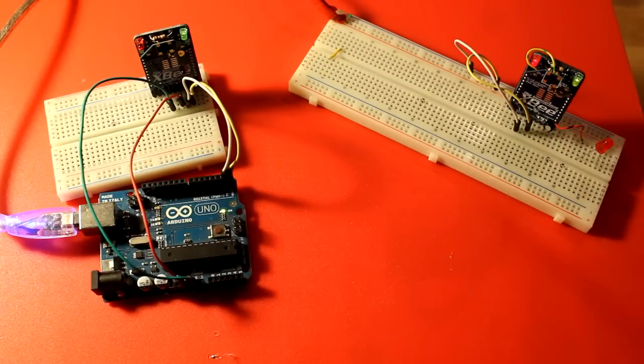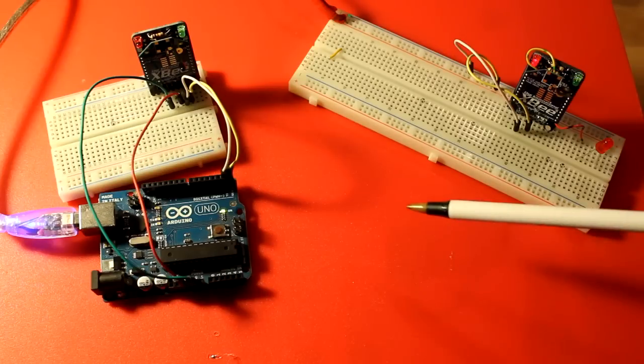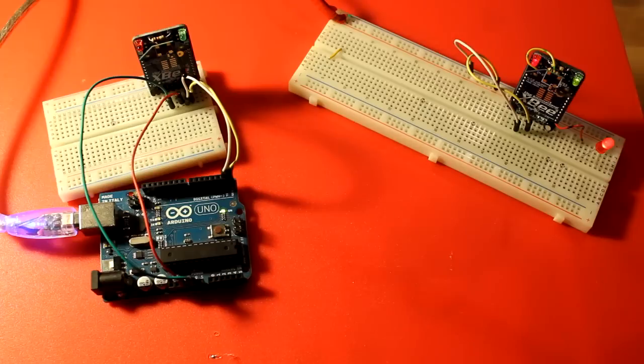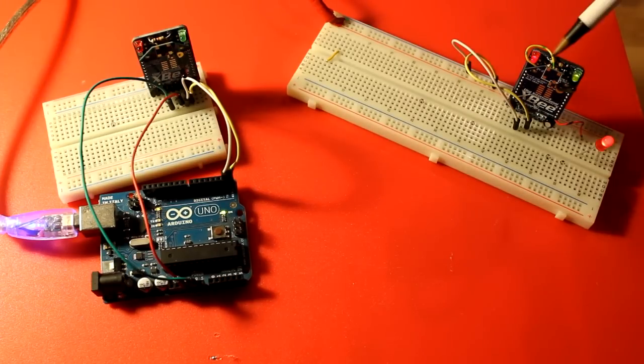Some troubleshooting tips. If your red light is not turning on between the two XBees, it's not even sending data. First, make sure you have the communication set up. If your checksum is off, it won't even send to the remote XBee, so the red light won't turn on and you won't see any communication between them. You also want to play around with the PAN ID — maybe set a new PAN ID, build a new network, restore the XBees back to default, and start over. Follow the directions I gave you closely. Another thing I noticed: watch the red light — that's when the initial frame gets sent to the remote XBee. It's about a second before the LED on the remote side actually turns on, so there's a slight delay between the two lights.